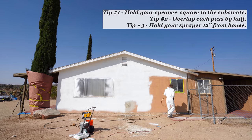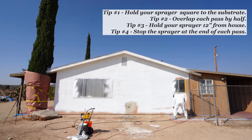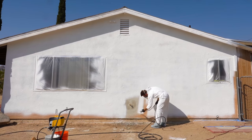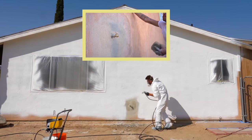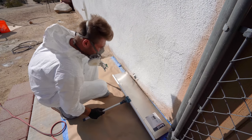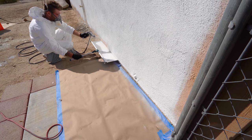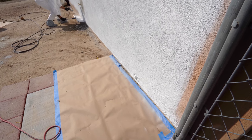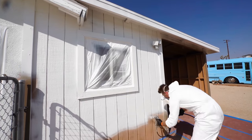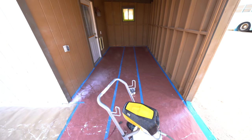My fourth airless sprayer tip is to always stop the sprayer at the end of each pass. If you keep your sprayer running continuously, you're likely to have drips and buildup on the end where it's not constantly moving. If you watched my last video, the DIY plumbing and stucco repair, you'll notice that I did not paint that area — I was letting that stucco patch cure an extra day or two before I painted it. This tool is called a paint shield. You can get a good one made out of metal or a cardboard one for about a buck, but they are really great for getting crisp lines, especially around the bottom and top of your house. I also should have used this to protect the bottom of my shingles when painting the eaves of my roof line — I didn't think of this until my last wall, so learn from my mistakes.